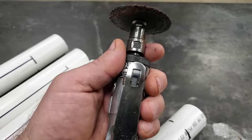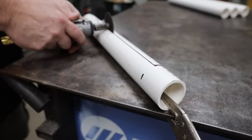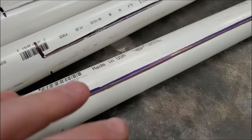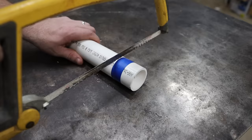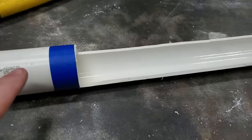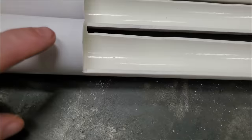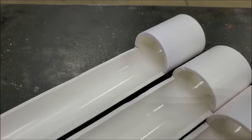You can use an air grinder — not very expensive. Dremel makes cut-off tools too, or you could use an angle grinder. I got my grooves cut all the way through on all my pieces of PVC. I'm going to use a piece of masking tape and run it from this cut to this cut, and we'll use that as our cut line to get our last cuts. I'm going to take my hacksaw and cut this part out — you could also use that grinder again. After you get your ends cut out, this is what it's going to look like. Then sand all this down good and wipe all the marks off with acetone. Next, we're going to cut a notch in this side on two of them, and on the other two we're going to cut it on the other side.